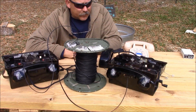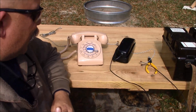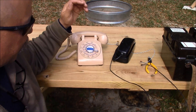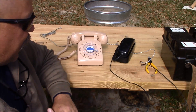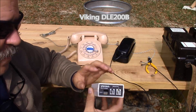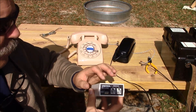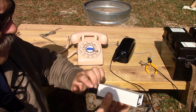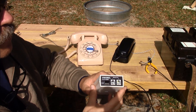For those who don't want to use field telephones, we'll discuss a way to press consumer-grade telephone equipment into service as a field telephone. Consumer telephone equipment uses what's known as common battery, meaning the phone line itself provides power to the transmitter, receiver, and ring voltage. One way to provide that functionality is with something called a ring-down box, which turns two telephones into a fully functioning intercom — either phone lifted off hook rings the other and provides dial tone. These are typically about a hundred dollars new, require an AC adapter providing 12 volts AC, and consume about 600 milliamps.